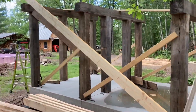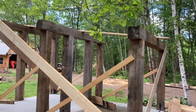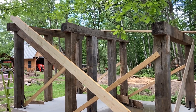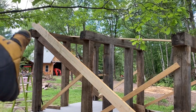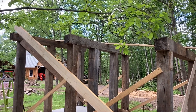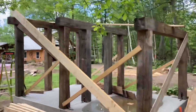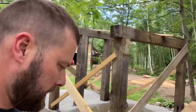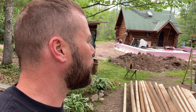I'm about to decide if I'm going to do a bird mouth cut on all of these. The book says you can do it either way — he tends not to and just shims that space created when you put the rafter on there. I'm going to see if I bird mouth cut them. Once I do one I'm going to pretty much do them all, because it's not like I have extra wood laying around.